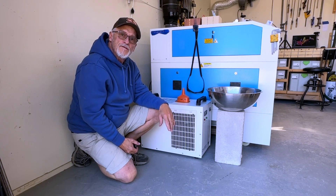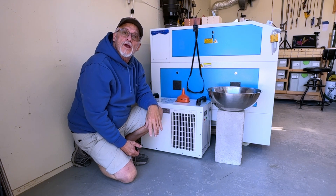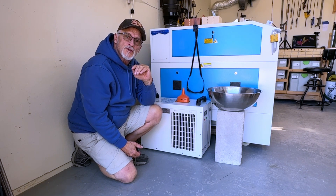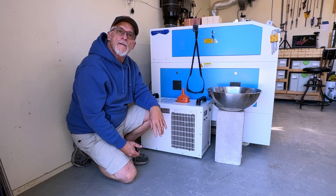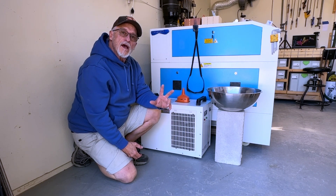We put in just slightly less than two gallons of distilled water, hooked it back up, and let it run for 15–20 minutes with the back cover open so you can make sure there are no bubbles in that laser tube. You should see no bubbles whatsoever. If you do, just pinch one of these lines a couple of times to disrupt the flow and get those bubbles moving.